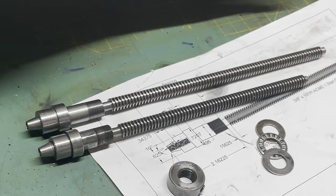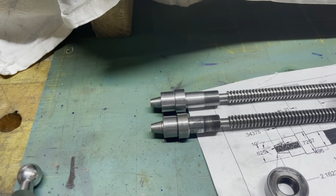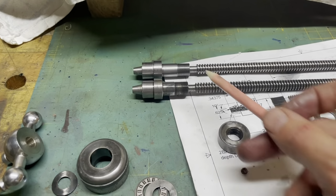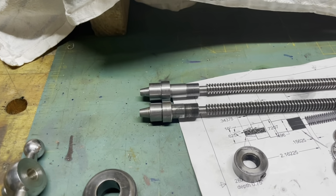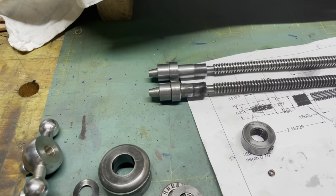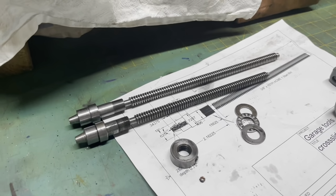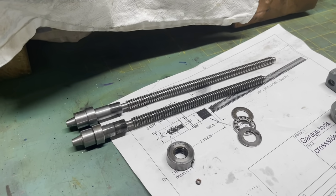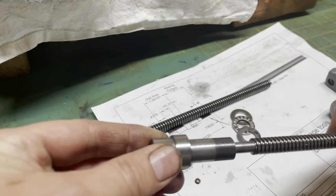I was making this shank ever so slightly longer to accommodate the thrust washers. So that's ever so slightly longer. That was planned for. The actual lead screw itself is longer because I had excess. No other reason. I had more than enough, so instead of throwing it in the scrap bin, I made the cross slide a bit longer than it should have been. It'll be fine. So the plan now is to clean these up